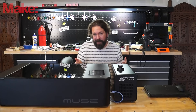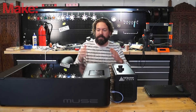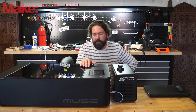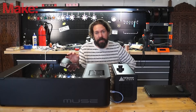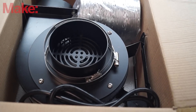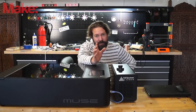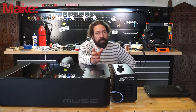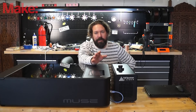Let's talk about fumes. You're burning stuff, so it's going to smell. With my cheap K40, it does smell because there are gaps everywhere and the extraction is not great. With this machine, I've been pleasantly surprised — it's sealed up pretty well. It has a built-in exhaust fan, and mine came with an additional high-power exhaust fan that's sucking even harder and extending the blow outwards. There are some materials you don't want to cut or engrave because they can produce poisonous fumes — PVC is off limits. You should research any material you're going to engrave before you engrave it.